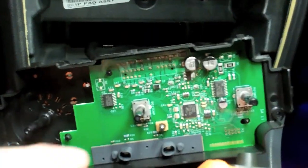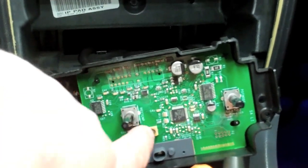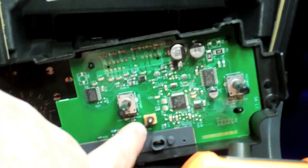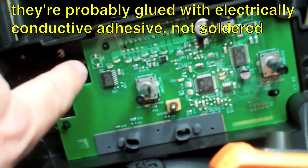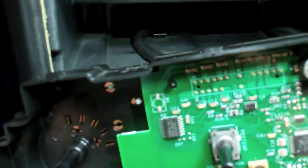That will separate. This is my air conditioner panel, and there's 3 bulbs, 2 of which were out. This is the only one that was working. These little things are soldered right onto the board, so when you try to pop them off, you pop the whole thing off, which just exposes those little tabs there, but they don't tell you if they're hot or ground.